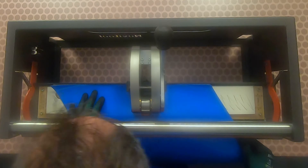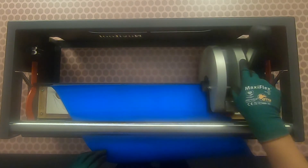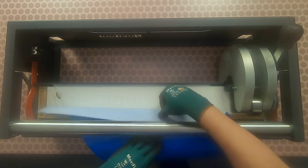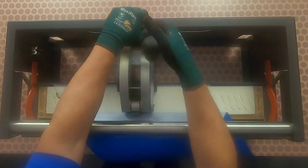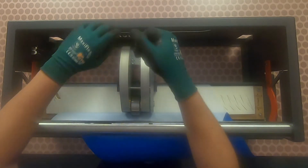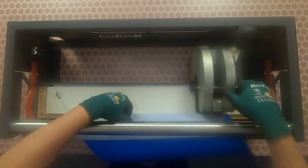Clamp the belt in place. Fold back the top ply of the belt so that it completely clears the punch block. Start by punching the bottom ply in the center and then at both ends. Complete by punching the remainder of the belt.